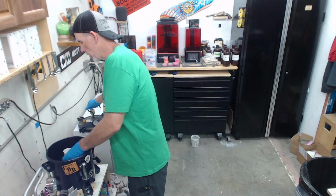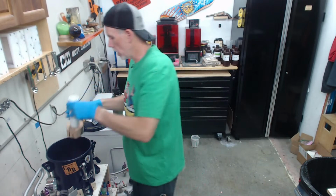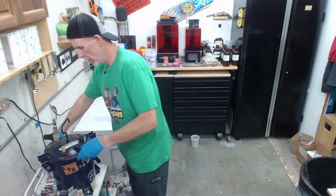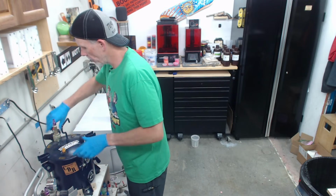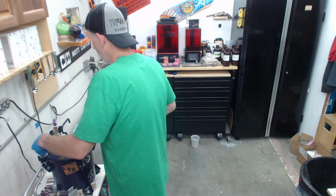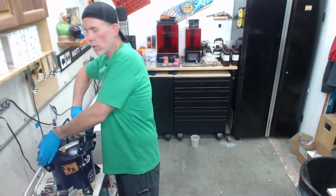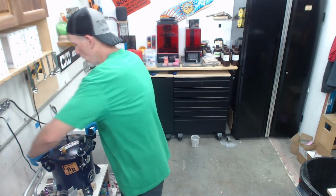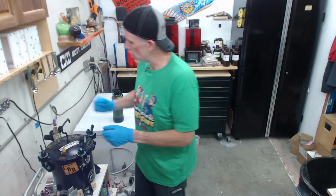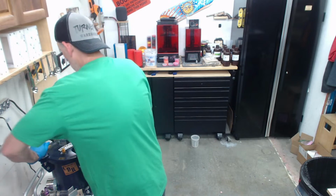And one little thing that I do, if I'm only doing one tube, I got a little base thing that I made. That way it doesn't fall over. You don't want your tubes falling over when you put them in the pressure pot. And actually, what I usually do, when we do the next round, I'd say 3 is a little bit better than just 2, because I grab a rubber band, and having 3 tubes gives it a pretty solid base. 2 of them is still a little bit rocky side to side. So I'll just have to be careful.